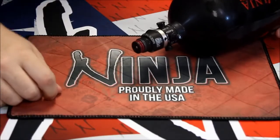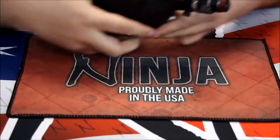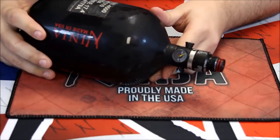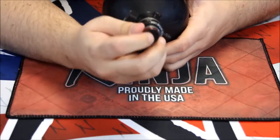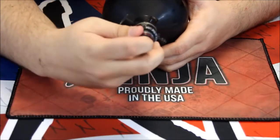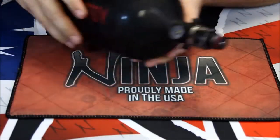Alright guys, so I pulled that off the ASA there. As you can see, it's fully empty. I don't know if you can see there with that gauge. There's no air in the system. One of the good ways to check this, and you always want to make sure you do this, if there's no air in there, you can quite easily push down that ball. If there is any residual air pushing that down, I'm going to let that out. We just want to make sure there's no residual air left in this bonnet up here.